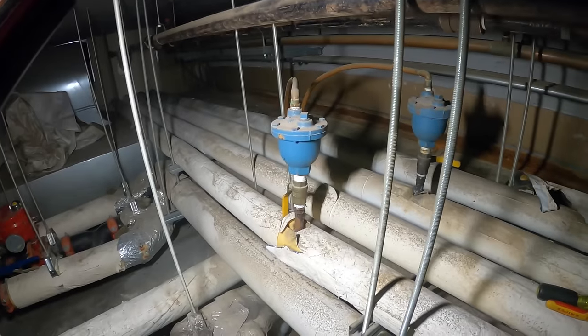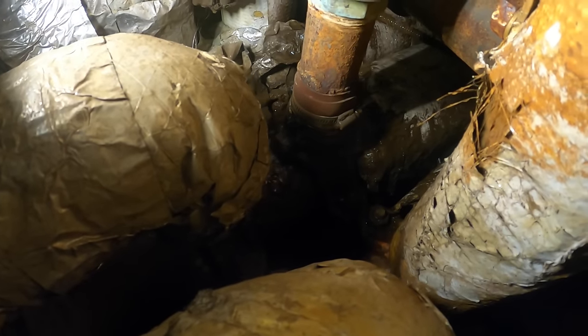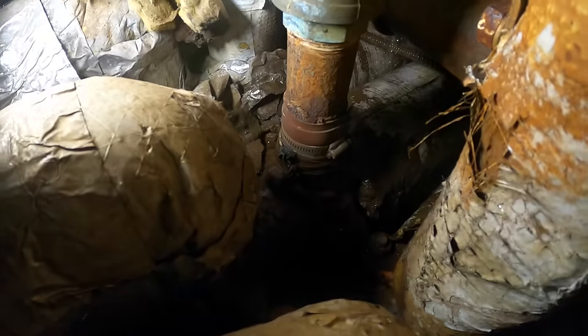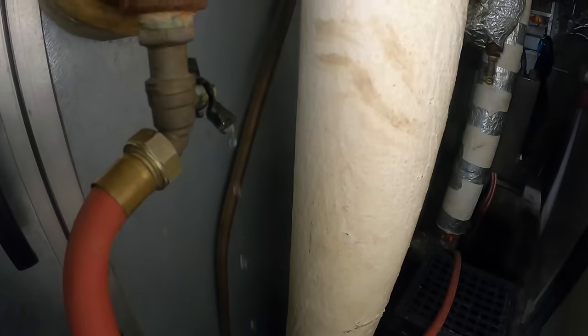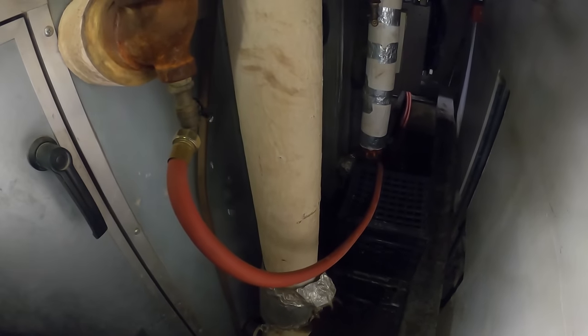At least I can be in here, but this looks like the only place we're gonna get in — there's a pipe in between and this elbow is in the way. It's gonna be very difficult to get any sort of pipe wrench in there, and there's a good chance this pipe will just break. It's so rusted, so bad — like you look at this thing wrong and it's gonna leak. These are the two hot water pipes, supply and return — got one hose connected here draining and another one there draining. Unfortunately it's this valve itself — see if you close the valve it stops. I try to tighten the nut here but this thing is done. A lot of water coming out of there.